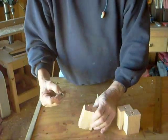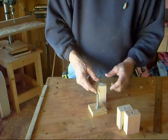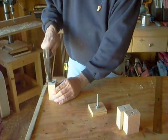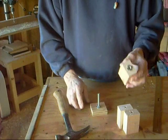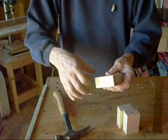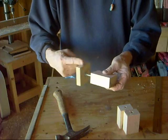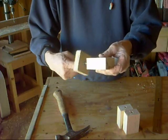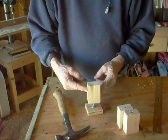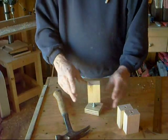Here's the block — this is what you'll attach to the leg. Take a t-nut, press it into the block, and screw the assembly together. You now have a foot and a leveling mechanism. Just glue the block to the leg, put a couple of screws in, maybe one through the side as well, and there's your adjustable leg.